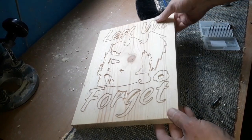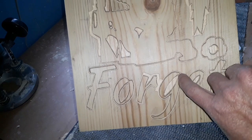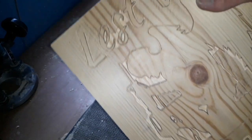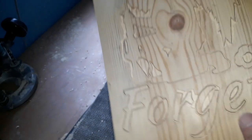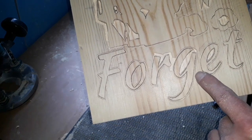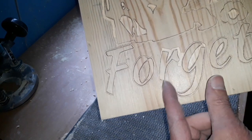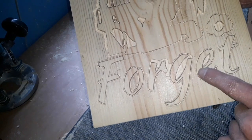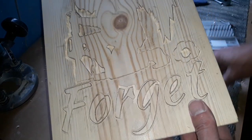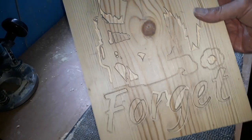You can see from that we've gone all the way around the lettering. I've removed the bits that are going to be a little tight to get in with the next bit — they're just a little delicate. Everything's all in order. Just remember when you're doing this line work: we're removing the background, so we want to be on this side of the line. Never route exactly on the line, because by the time you've gone down that side and up the other side it's going to be a lot thinner than it should be. If we're removing the background, route on the outside of the line so it just comes up to it — don't go on the line itself, or everything's going to look a lot smaller.